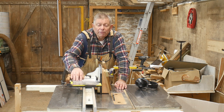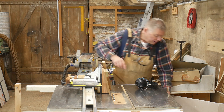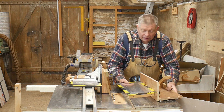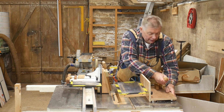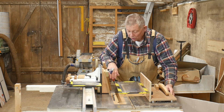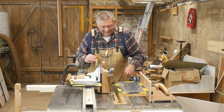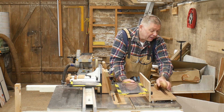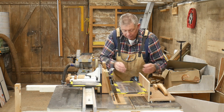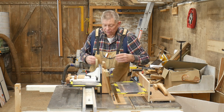You'll notice that I can't use my guard — it doesn't go round when this is on. I've never used my blade unguarded, so I've got my magnetic stand-alone guard like that. When you set it up, I have to make sure that it doesn't foul the workpiece or this guard — I found that out the hard way. So actually that can go in a wee bit. The only way I can get my hand in there is if I do so absolutely deliberately.